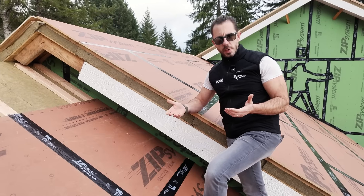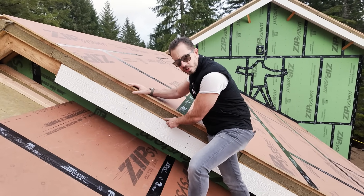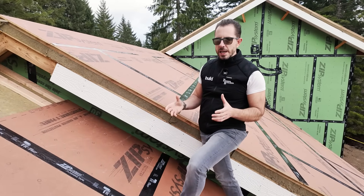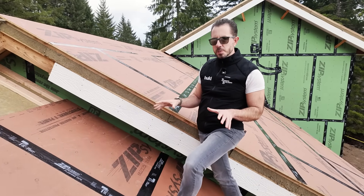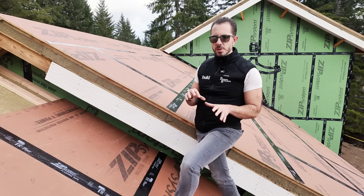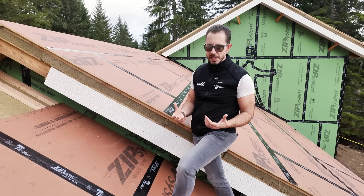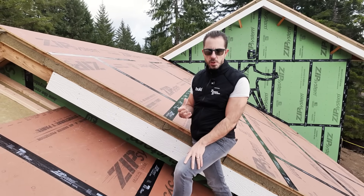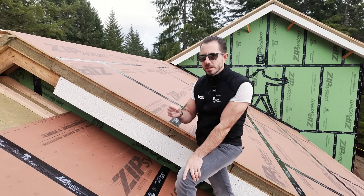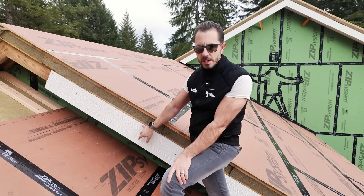In this case, they're I-joist rafters from PWT. Very conventional — this is just going into your I-joist rafters. Instead of trussing it, we're able to have a lot of open volumes architecturally, but we're also able to have the volumes to put our mechanical systems inside that conditioned space. That's primarily what we're trying to accomplish here: to bring our mechanical equipment as well as ductwork into conditioned space.